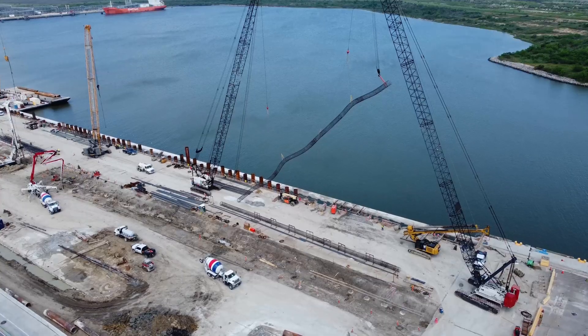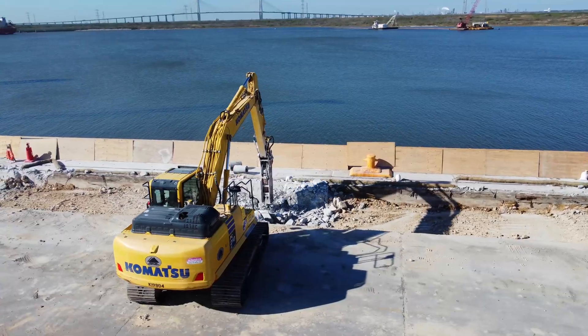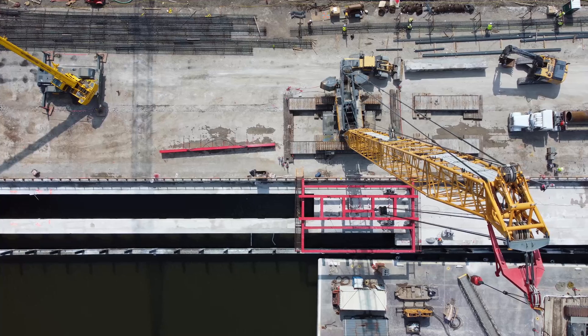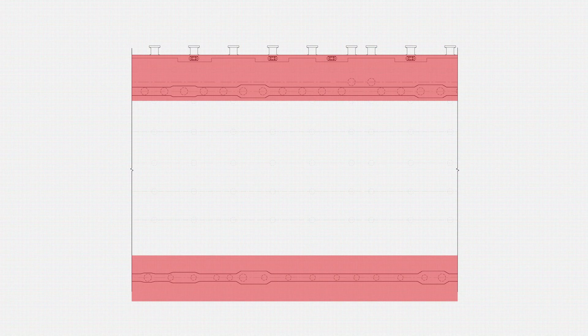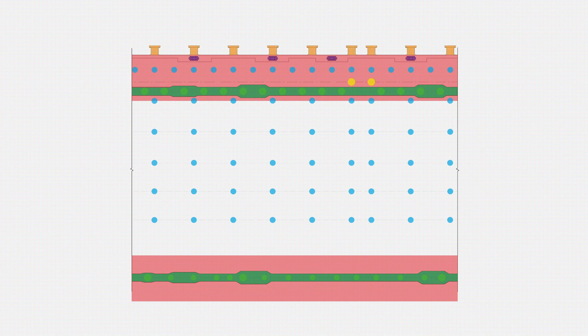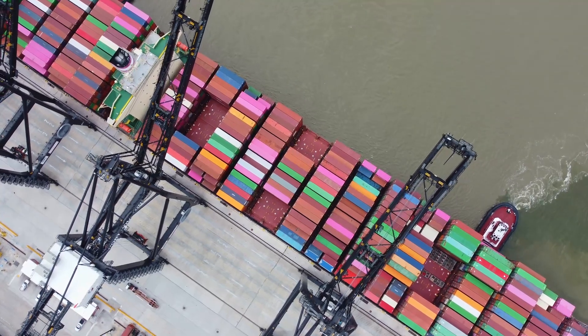Landside piles are 150 feet deep and waterside piles are 200 feet deep. A strip of existing deck needs to be demolished at the waterside and on the landside to open space for new lines of piles, so both the surface and structural decks will be fully demolished there. Here is the plan: fully demolish two strips of deck for new piles; build new piles; repair all existing piles that need repairs; build new crane beams and rail over newly installed piles; replace the surface deck and build a new support building for stevedores; and install a new fender system and bollards. At the end, we will have a brand-new wharf suitable for modern container cranes and ships.